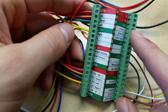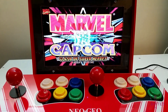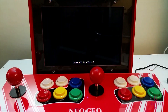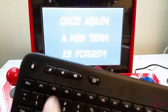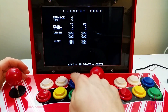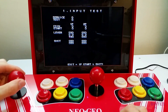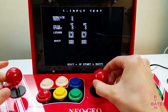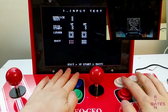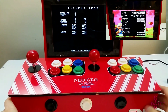To verify all is working and there are no conflicts, I recommend launching a game you're familiar with that uses all buttons possible in a 2-player game — a typical Capcom 6-button fighting game works well. When that game loads, launch the ROM's diagnostic mode for the arcade cabinet and select the input option so you can check each individual input. We can also see how Capcom maps their buttons compared to other 6-button fighting layouts, which varies by developer. This can be reconfigured on a game-by-game basis within the emulator. Be sure to preserve the main config file created after you start remapping main emulator keys within RetroPie.